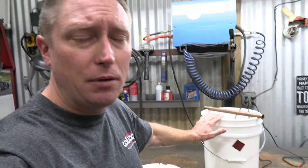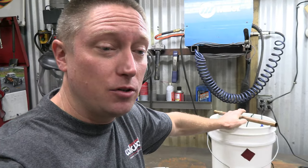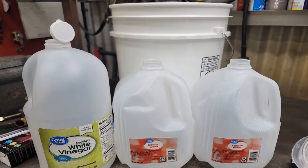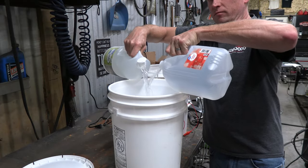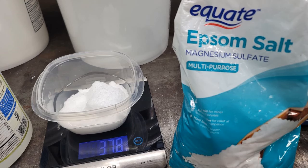The first thing you've got to do is build your electrolyte solution. I've got a five gallon bucket here — I'll put a link in the description where I got them on Amazon. I start off with three gallons of distilled water and then add one gallon of distilled white vinegar. From there I mix in about 1,100 to 1,200 grams of Epsom salt. It's worth mentioning that you're supposed to use Epsom salt and not regular salt because regular salt will supposedly create chlorine gas in this process. I don't know if that's true or not, but just in case, I use Epsom salt.